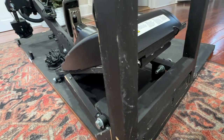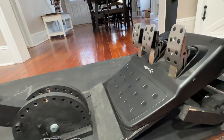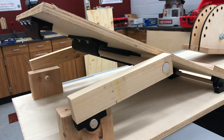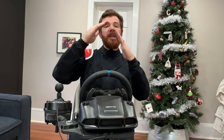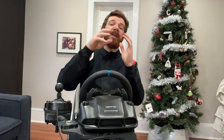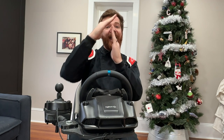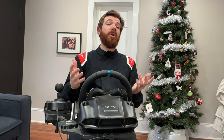The next thing I created was the pedal rest — a pretty simple table. I ended up adjusting the pedals in two possible ways. The first is that the whole table is on a pivot using 3D printed parts. I made an arm that reminds me of a lawn chair, where there are hooks on the bottom of the plate — you can lift it and move a wooden dowel and lower it, giving you three possible angle positions. That, accompanied with Velcro which allows you to move the whole pedal assembly up and down the table, gives you nice angle adjustment and also pedal position adjustment, using 3D printed brackets and a series of bolts to hold it together.